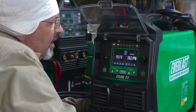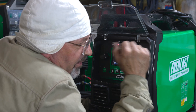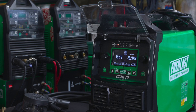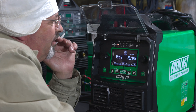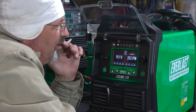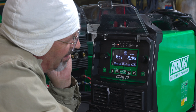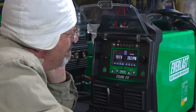Dialed in — that works, that's cool. Imagine doing ornamental artwork around homes, custom builds — you break up the heat. You don't want to weld it solid, you don't need to weld it solid. Like thin gauge body panels — you could set a real short spot and a pretty long stitch. That'll give you time to get down your seam an inch or two and do a little spot. I want to see you run it on that three-eighths plate you have set up — down the bevel. Crank up our voltage and wire speed and see what it does doing a spot-stitch combo.